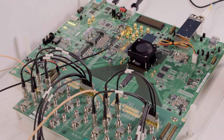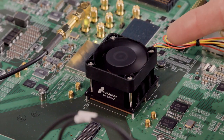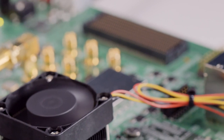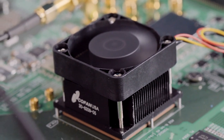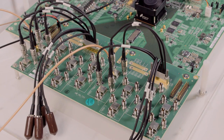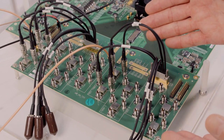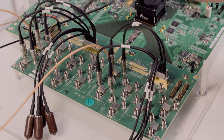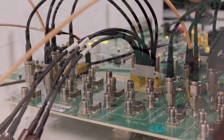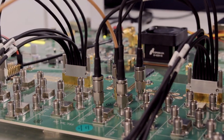Let's take a look at the demonstration setup for today. Here in the center, we have the ZCU670 RF evaluation platform, and on that board, we have the RF SoC DFE ZU67DR device. The ZU67DR device is an 8x8 configuration, which includes not only the hard DFE IP, but also the RF DSP ORAN reference design. In addition to the ZCU670, we have an XM655 board that plugs on and has low, mid, and high output frequencies. Today we're going to be doing the test at a lower RF frequency to enable the maximum signal dynamic range without post-amplification, which is typical of regular implementations.